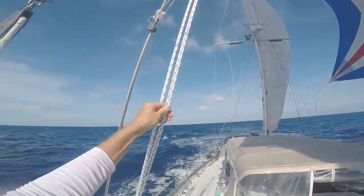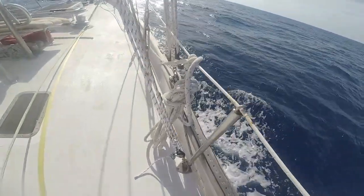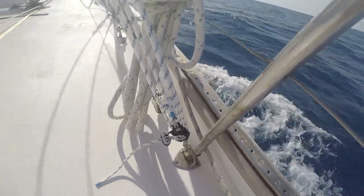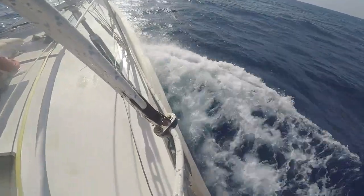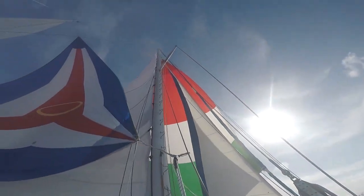This is a four-to-one purchase here — this is what adjusts the tack of the mizzen staysail. And then these are running backstays that are not attached right now — these are running backstays for the main. They go up there and attach.